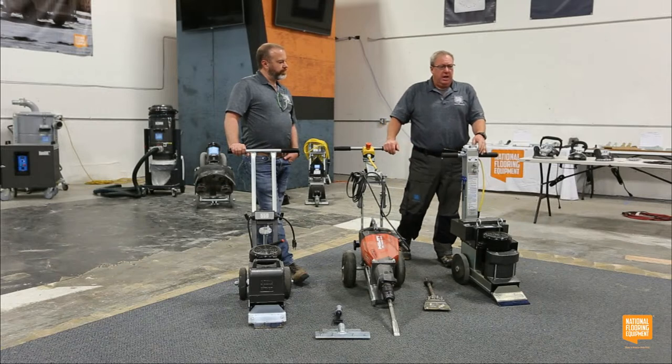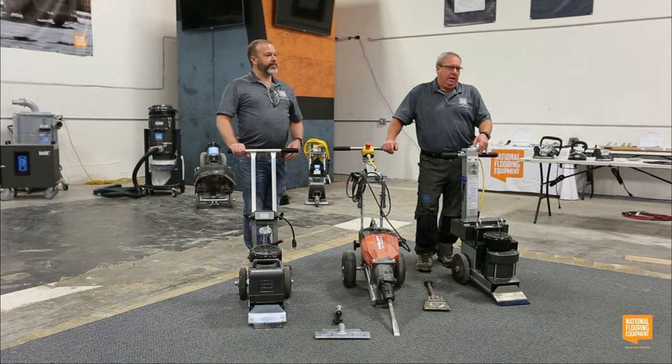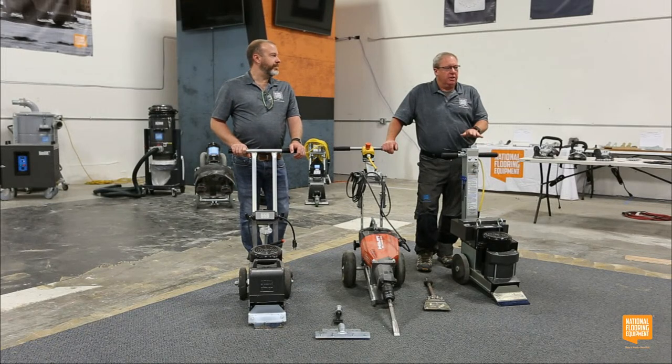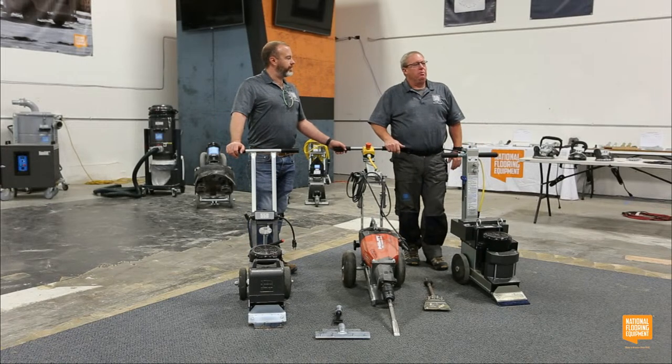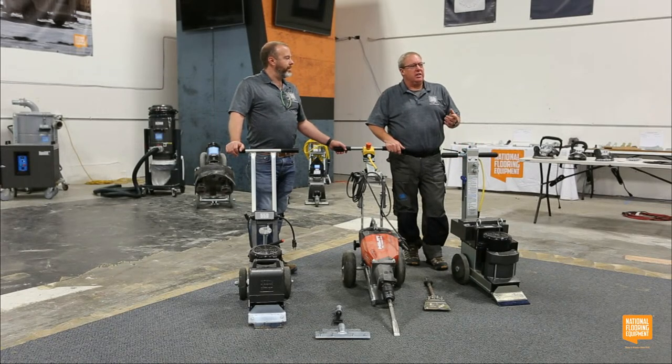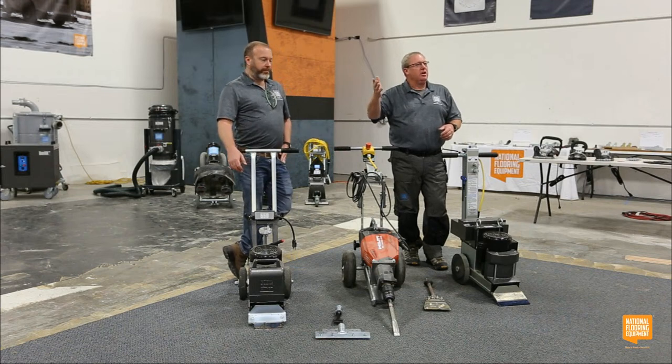And the first question I ask is, is it turning off the vacuum too? Yeah, the vacuum shuts off at the same time. Great. You're on the same 20-amp breaker. This is pulling 11 or 12 amps, your vacuum's pulling 12 amps. You're pulling more than 20 amps, so after it runs for a while, it's heating up and shutting off. Get an extension cord, run your vac to a different 20-amp breaker.